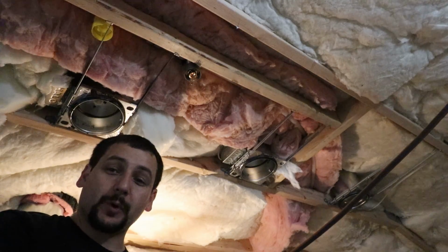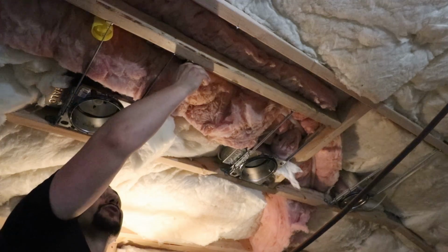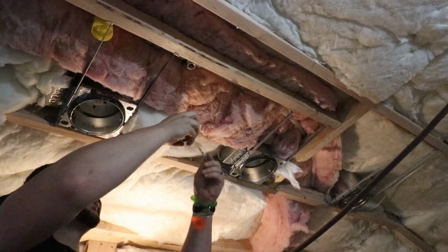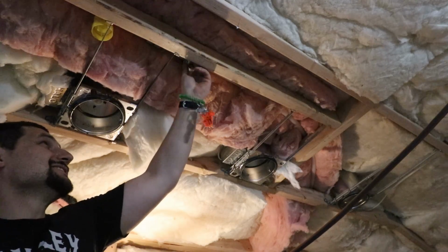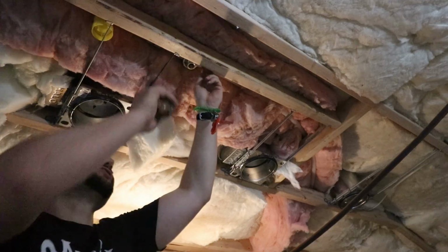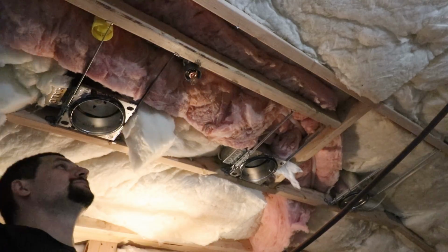So, this type of sprinkler head from Uponor requires this ring. And this ring locks the T-assembly onto the bracket, and it needs to be installed before the sprinkler head is installed. So hopefully, it's still hand tight, which it is. So we push that ring up onto the T-assembly. And then grab a wrench. We're going to thread our sprinkler head in.